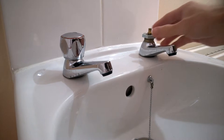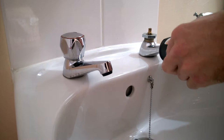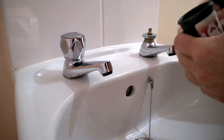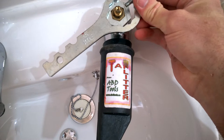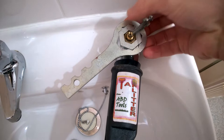Now I'm going to familiarize myself with how this works because I don't remember. I know that goes on like that. There are these sleeves inside, so we'll select an appropriate one - the bigger one's okay. So you don't need them all - you find your nut, make sure that's a good fit, take the large piece and slot it around. Then you screw this piece in just so it holds, it doesn't have to be super tight - just keep it nice and square. You can see how that fits on there.